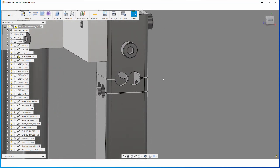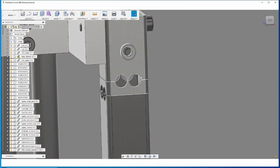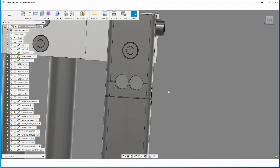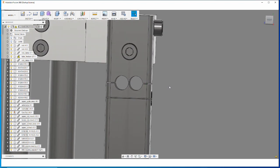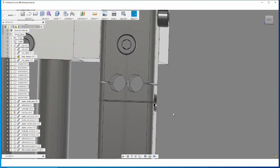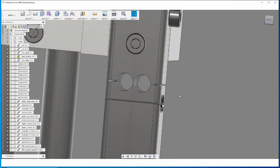At first I tried to wire cut the complete flexure. The holes are cut on one side and that's okay, but when you start cutting the other side, everything is fine until you pass a certain point. After that, the material starts to deform because there is internal stress. Because everything is so thin, the deformation can be quite large. The part starts to move but the EDM machine does not know this — it keeps right on track — so you get a deformed cut.